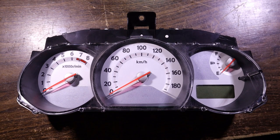You're looking for the pin that goes to ground, and then at least two pins that go to some form of diode, and then off into the rest of the circuit. And that's about all they do. They don't go anywhere else that I've seen so far. They just go straight to a diode, so it's almost a dead giveaway.